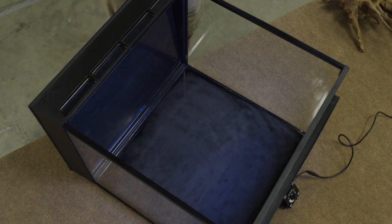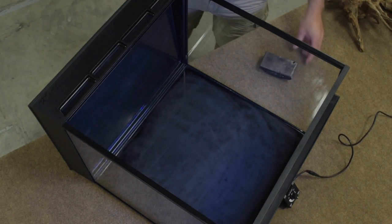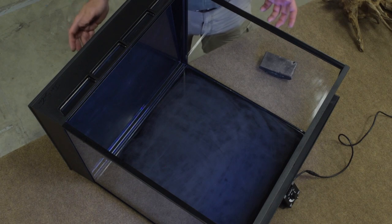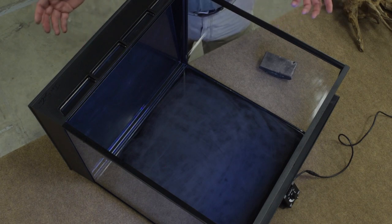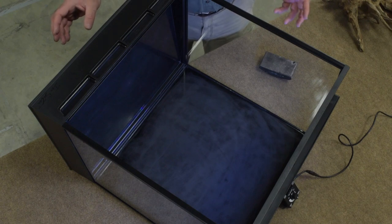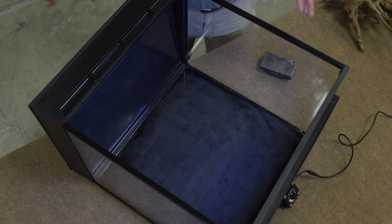What we'll do next, to make sure everything stays good for bonding, is we'll vacuum it to keep it clean. You do not want to contaminate a surface like this once you've scuffed it. Keep grease, oil, soap, anything that will create a parting film on it, away from it, because that parting film will cause your rocks or whatever you're adhering to come off.